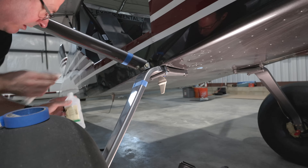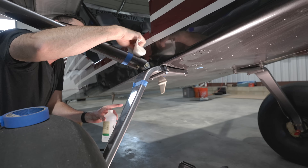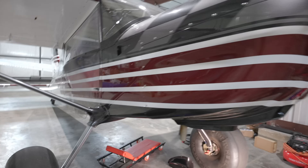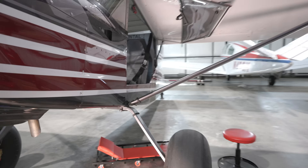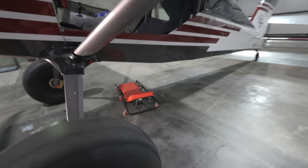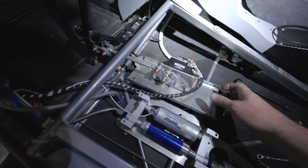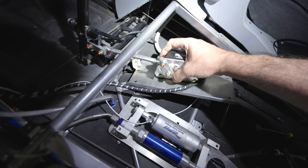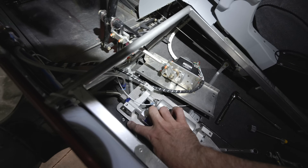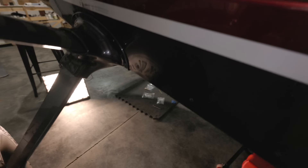Just using a little bit of alcohol to help the foam tape adhere. I confirmed that the tape goes actually on the aircraft structure rather than the fairings themselves. This one was quite a bit more difficult because of all these components right here. The autopilot pitch servo had to loosen to move out of the way, and then the boost pump as well — I had to move it out of the way to get to this nut right there. So we're going to secure these and then go fly and test out — see if I gain any speed back with these big bush wheels.